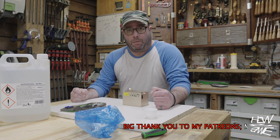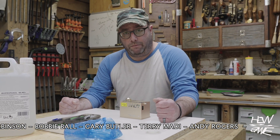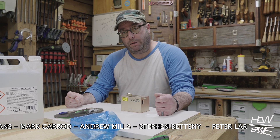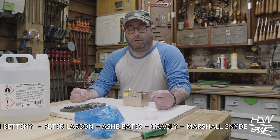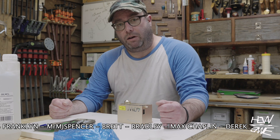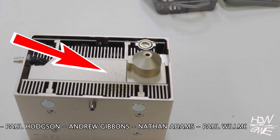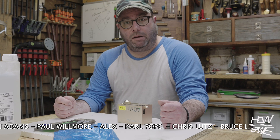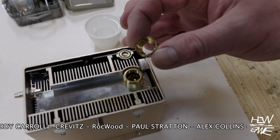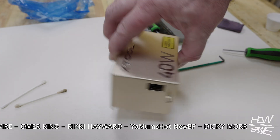Bad news — I've been using this for hours and hours burning away, and according to xTool you need to clean this every 30 minutes. 30 minutes is if you're not using air assist; it's a bit longer if you have been using air assist. With a 20 watt or 10 watt laser you've got more time between cleans. Obviously if you're engraving something for an hour you're not going to stop halfway through and clean it. I've been using this for hours and days without cleaning it. When I turned it over it's not beautiful, but I want to take it apart and give it a clean — just the lens and the fans really. The lens is cleaner than a clergyman's conscience; giving it a wipe with a bud, there's no doubt on that. That all took about 10 minutes to clean the lens and fans.